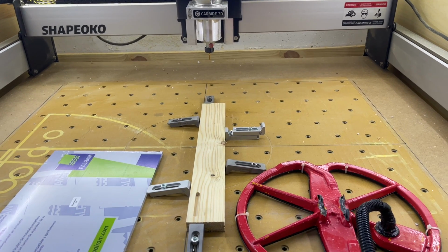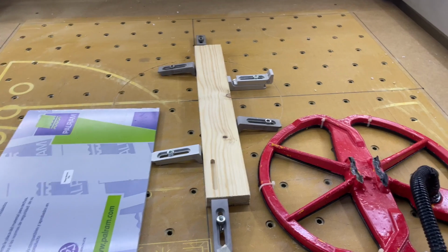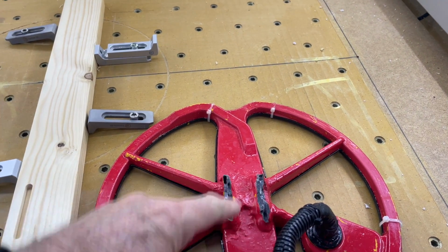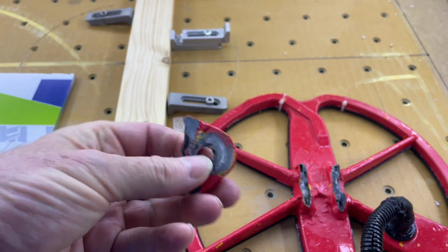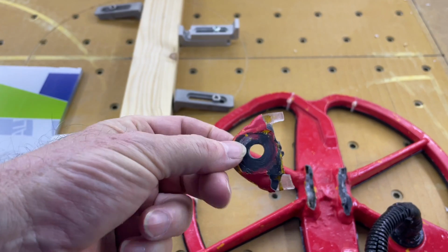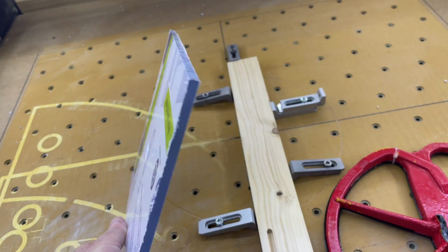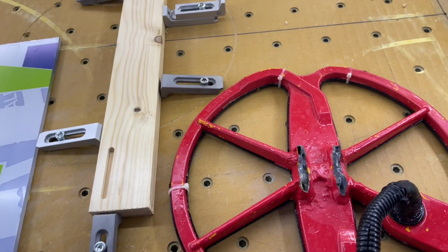Okay, I have a slightly different project today for the CNC machine. I have a friend who keeps on breaking their metal detecting coils. Last time the coil ears were repaired with acrylic. Unfortunately, as I found out, the acrylic is very prone to breaking, so I've bought some 6mm thick polycarbonate, and the idea is to make new ears.